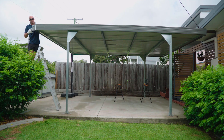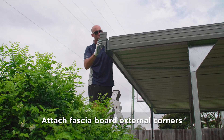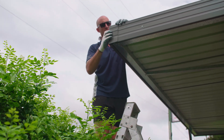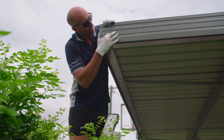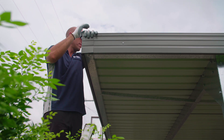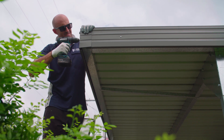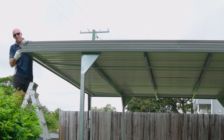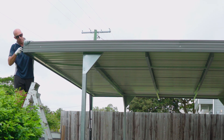Once we've got our fascia board on, now we need to cover our corners where that fascia board joins - that's where we use our external corner. Following the profile of the fascia, that corner just sits over the top. As you can see, the grooves in the fascia and the grooves in that external corner will match up. Then we just drill and rivet through those to connect them together. Get one side lined up, and you can manipulate and twist them a little bit if your other side isn't lining up perfectly.